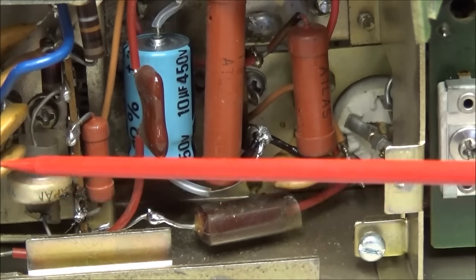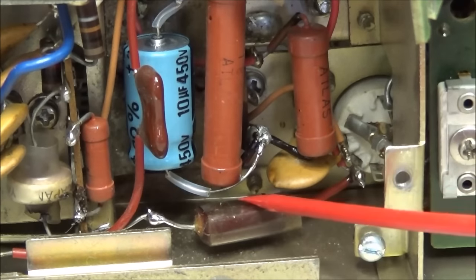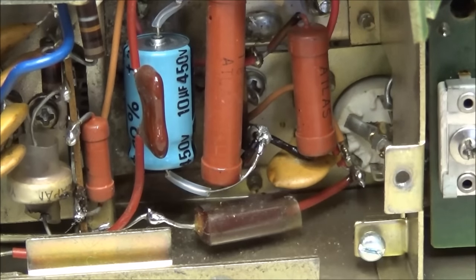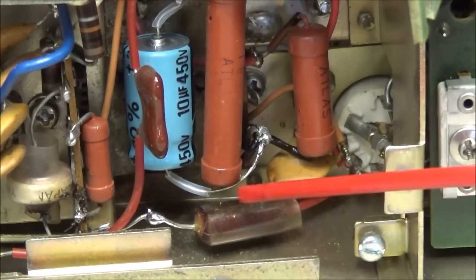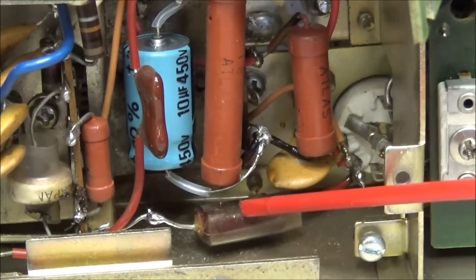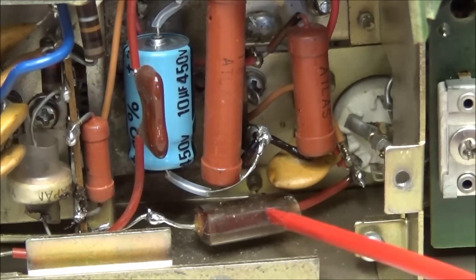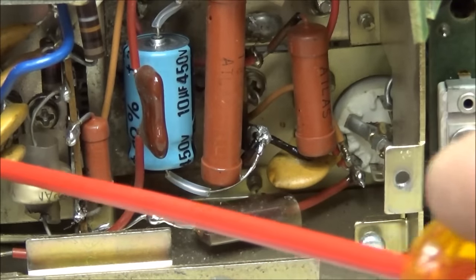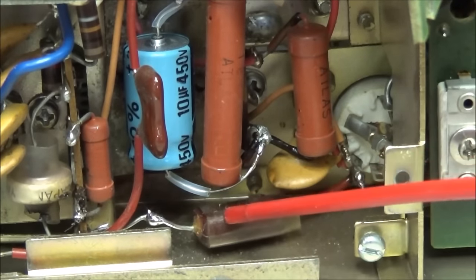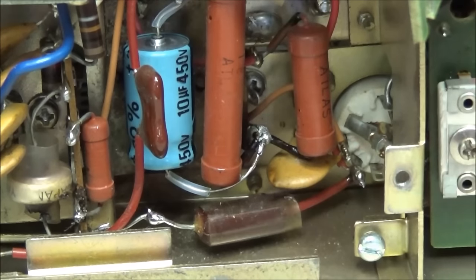So it's always good to take this capacitor, and don't even worry about checking it. You can, just to see how bad it's failed, but you need to go ahead and replace that, and always replace them with a 2 to 3 kilovolt 82 picofarad silver dip. And this is a coupling capacitor that goes from our driver tube right on into our final stage. So this capacitor gets a lot of heat on it, so it's always good to replace it.